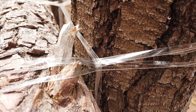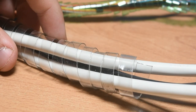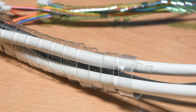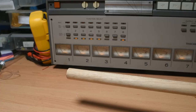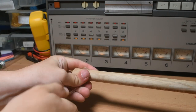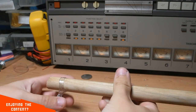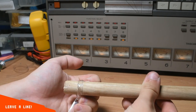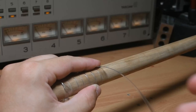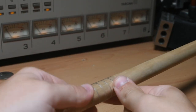Let's start with my personal favourite use: making custom cable wraps. I love this because you can make wraps in any size and colour combo to suit the project you are working on, and it's really easy to do. First, choose the diameter of the wrap you want and find something — like in this case a dowel — that matches that diameter. Make a slit in the end, or just tie the cordage and heat it up, then wrap tightly, ending either in another hole, groove, or by clamping.